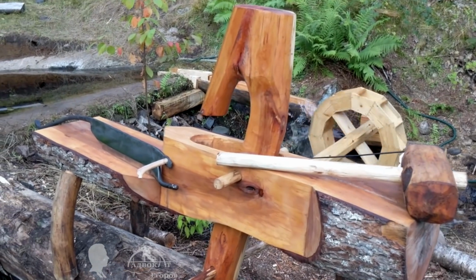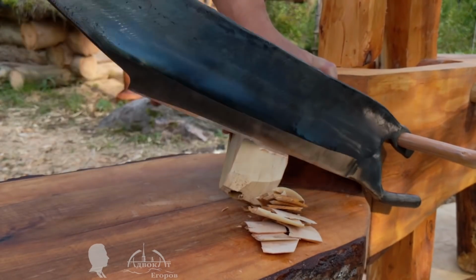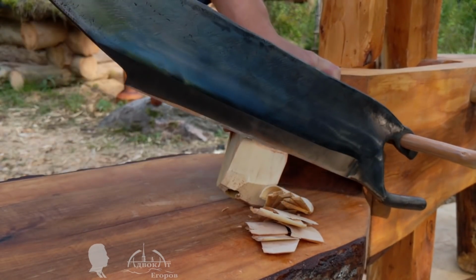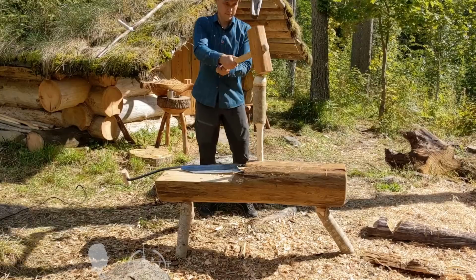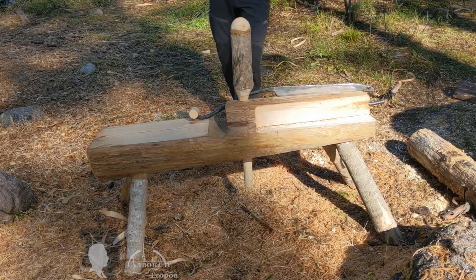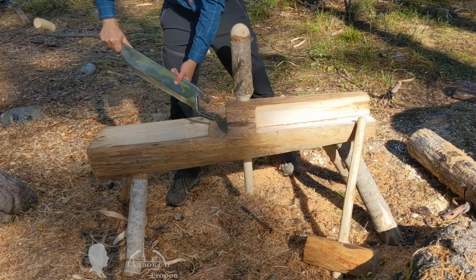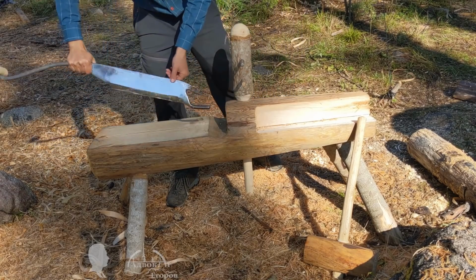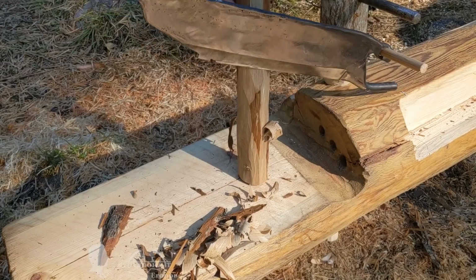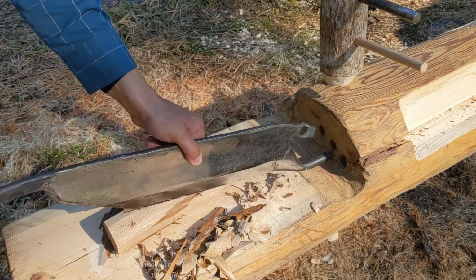The fact is that a traditional Cloggers knife is equipped with one of two types of cantilever mounting attachments, which allow the workman to exert great forces on the knife's cutting edge when required. Either a hook that is engaged into an eye in the workbench, or a pin that is inserted into a hole at the desired height from the base block. Both mounting methods have obvious advantages and equally obvious disadvantages.